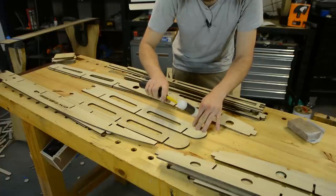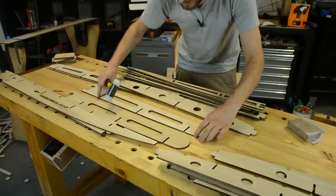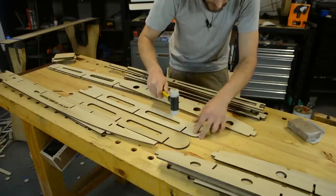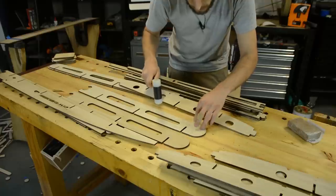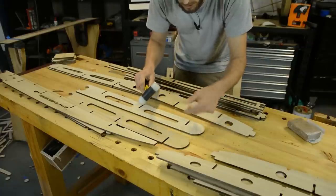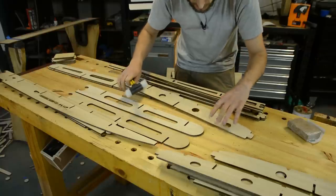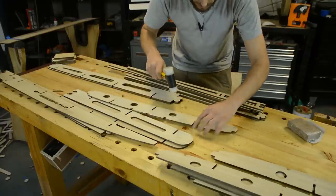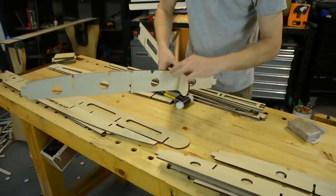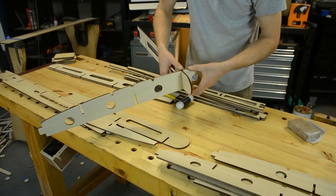The other method we can use is compression. Here I've just got a hammer, and with the material fully supported on the bench I'm going to compress the fibers just below the slot. This is going to compress the fibers, make it thinner, but also when we apply some glue onto that it's going to make it swell back and create a nice snug fit. You do that on both faces — and you can see it just slides together, and once we put some glue on that things are going to go together really nicely.